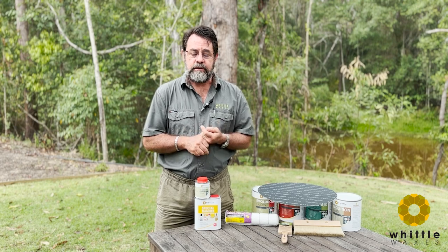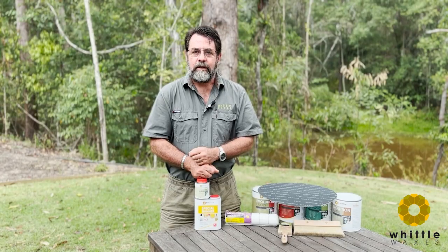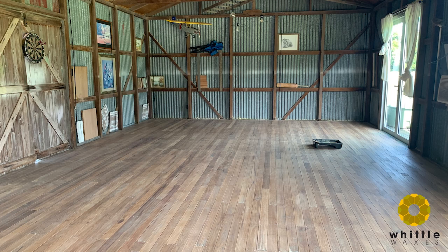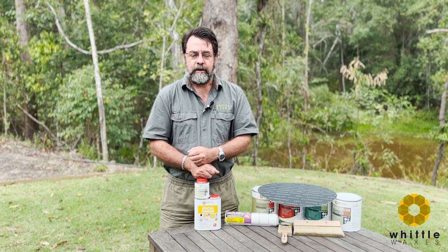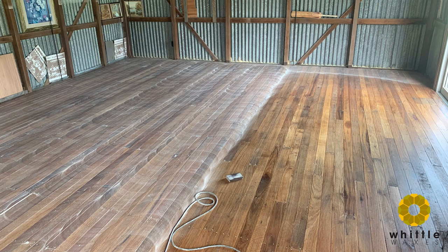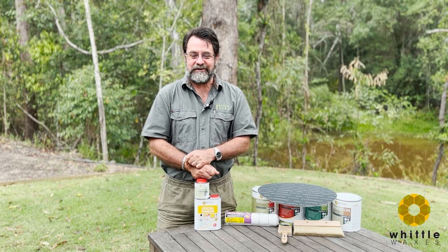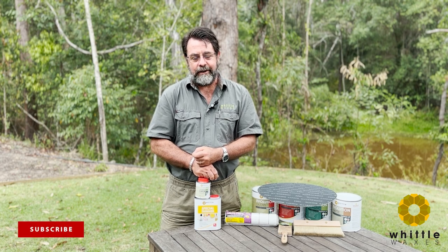Applying hard wax oil is really not that difficult — it's something you can certainly do yourself, and we love the fact that people give it a go. To finish up, let's look at the shed floor we did recently. First, the floor before anything was done. We then gave it a light sand using a buffing machine to keep the texture and heritage look rather than grinding it flat. The first coat was put on the floor, then the next day it was lightly sanded — you can see the first coat with half the floor sanded. Here's the end result, all finished with its final coat. From this to this — I think you'll agree the difference is looking great. And thankfully no cock-ups. This guy paid us a visit on the floor halfway through the process. Thanks for watching — we hope you find this helpful. We look forward to seeing you next time. Please subscribe. Cheers for now.